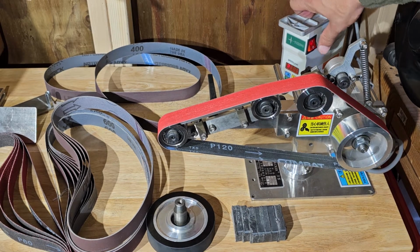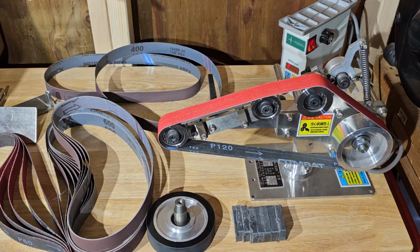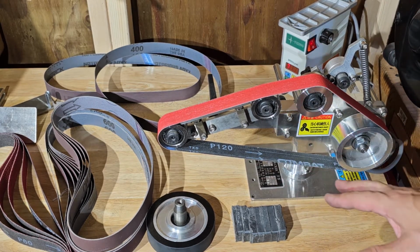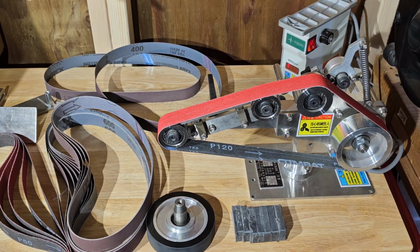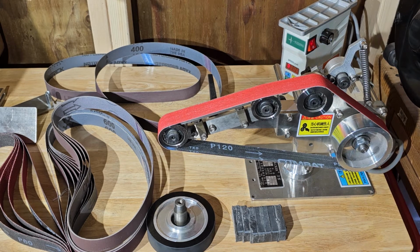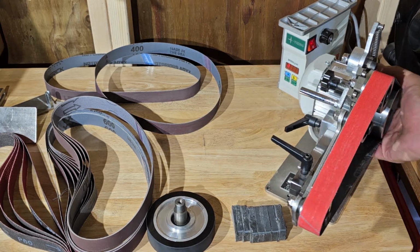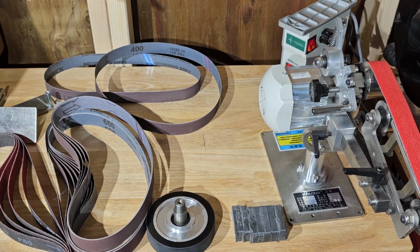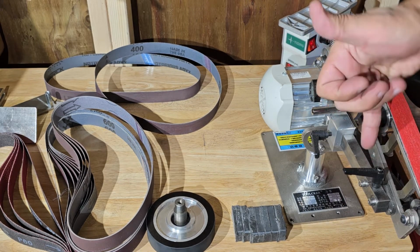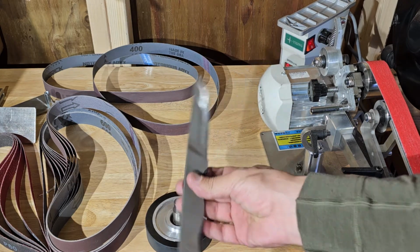We're going to shut this belt down. A little quieter in here now. So when you get done with these, maybe run a magnet around it and then either blow it off with compressed air, or it's even better to vacuum, because then you're sucking everything away from it. But you don't want these to build up with little metal particles all over them, so make sure you keep it clean. Looks like I need to wipe it down or do something with it, run a magnet by it. We got our file knife here.